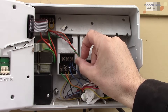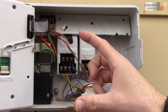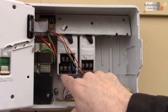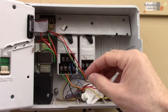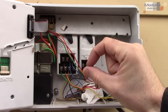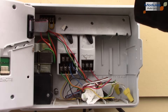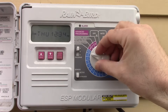Here's how the wiring works: each sprinkler valve needs two wires. You have the common wire, and then individual wires — green, yellow, orange, brown — one per station. The controller sends an electrical current to the valve, and as long as it's receiving current the sprinklers run. As soon as the electricity shuts off, the valve closes. To add more stations, buy more modules and you can go all the way up to 13.